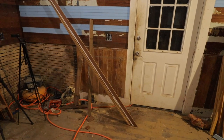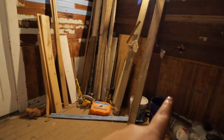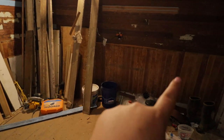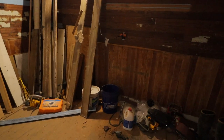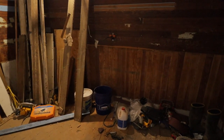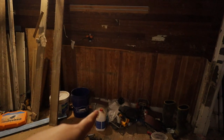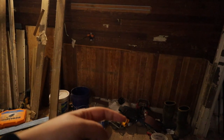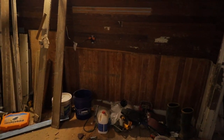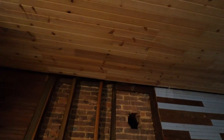And we're going to do it that way because if you remember, I spent hours and hours peeling all of the paint. I know you can't see over here. But peeling all the paint off of these boards just so that I could reuse them. And I'm not about to go spend another $300 on boards just so that we can put all new up that runs to the floor. So what we're going to do is just kind of hide the mistake and put a 1x4 vertically and then put the baseboard on top so that it matches and it doesn't interfere with the new floor that we're going to put.